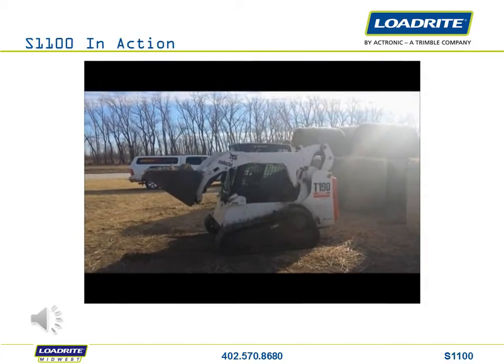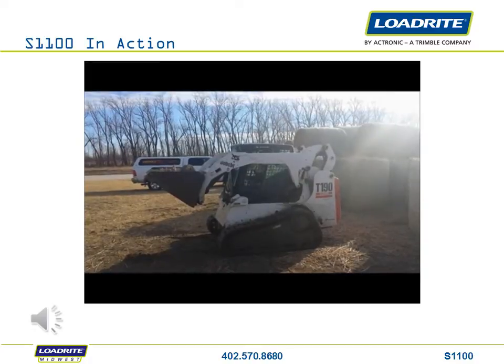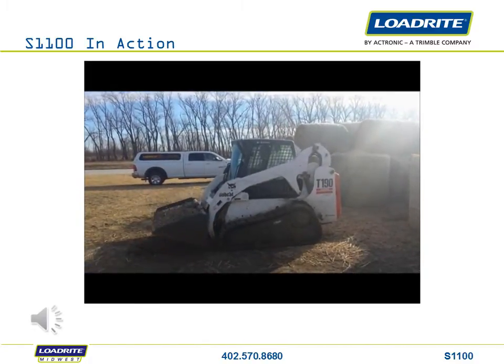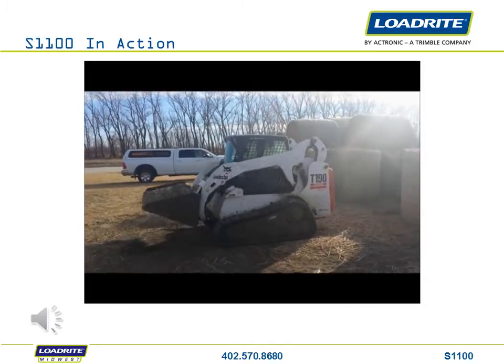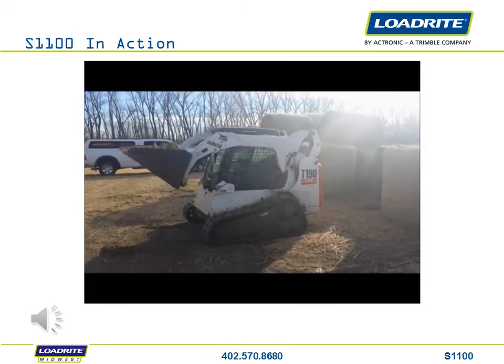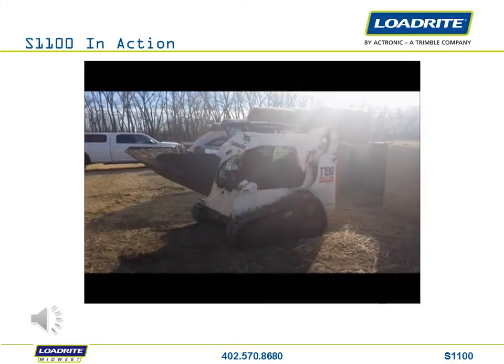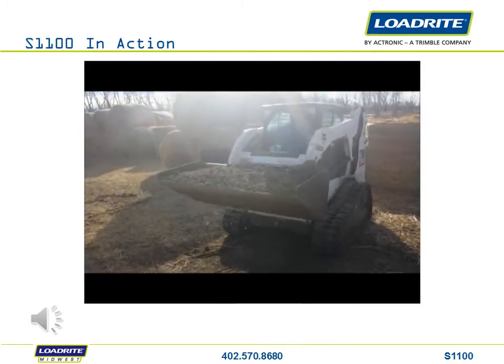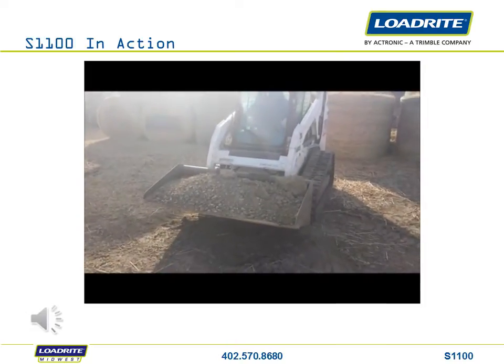This is the S1100 in action. What you're seeing is us weighing rock and round bales of hay. We're showing the weigh process where you lift it up to the red line, drop it to the yellow line, and then when we get to the yellow line, we push the weigh button, and that gives us our weight. And then we hit our add weight, which adds the weight to the next bucket.